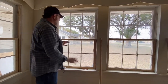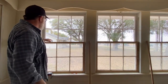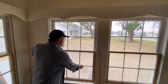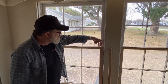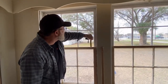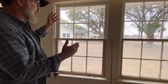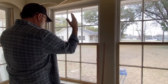Take that deep breath. Now what I'm going to do is position these window sashes in the opening so that this meeting rail and that meeting rail are somewhat parallel. Watch, I'm just gonna see inside of that. That's about parallel, I feel it with my fingers. I'm gonna measure what that distance is with this measuring tape, and that says a half inch there. So I got it parallel. What I now am dealing with is my sashes are in the opening like they should fit this way.